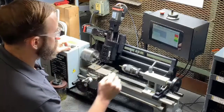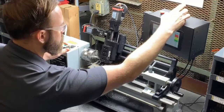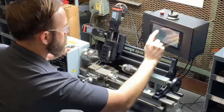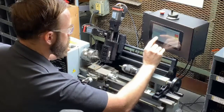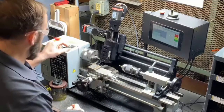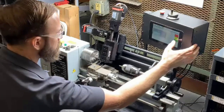Now we're just flipping our direction of our spindle, selecting that OD turning program, and then putting the multi-form controller into boring bar mode through one of the menu settings. Finally, just a quick press of the slice button to regenerate all of the G-code using our prior cutting parameters there, and we're ready to go. Cycle start.